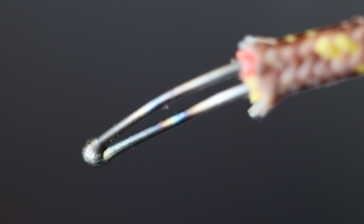This works differently than the devices we talked about before. If you take a look at this one — and they come packaged in all sorts of different things, sometimes with a big probe on the end — this particular one just looks like two pieces of wire that come up and are welded together at the tip. But that weld in the middle is the important part, because the two wires welded together at the tip are made of two completely different materials. And that is how this thing works.